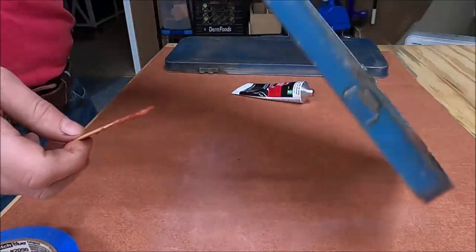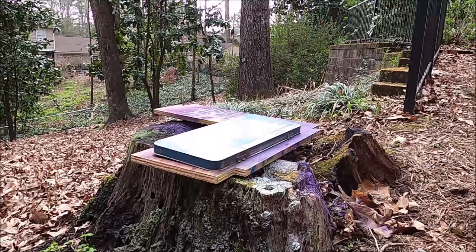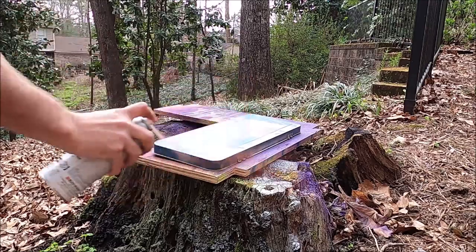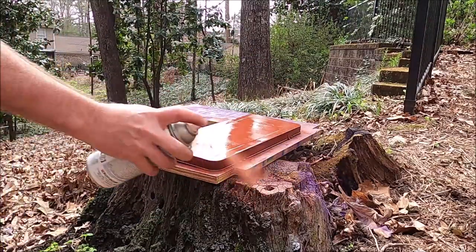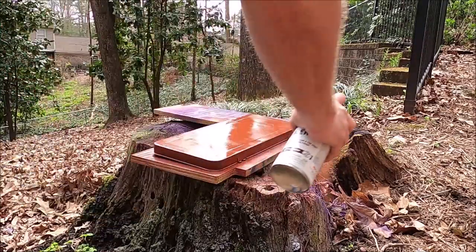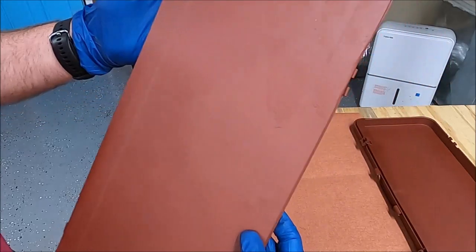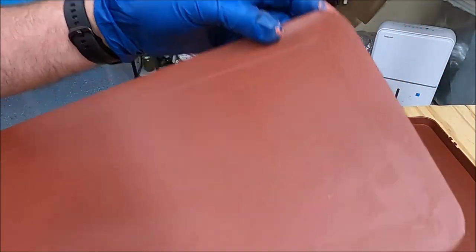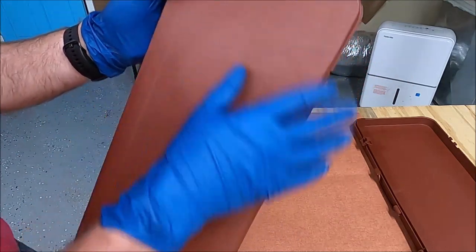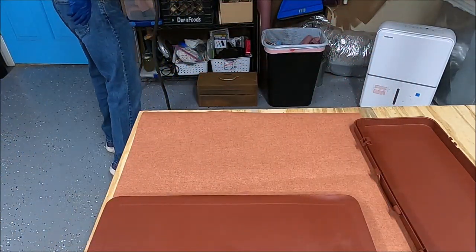There were a couple of little spots I had to fill again. Off camera, sanded it down, and then once I got that piece ready, took it outside and put a coat of primer on top. The primer actually makes it really easy to see the dents I missed — here's one — and the rough edges where I didn't do a good job of sanding the Bondo away.